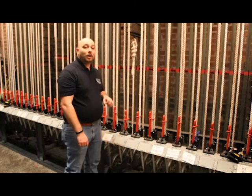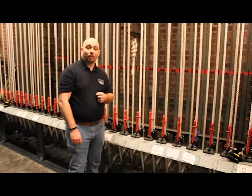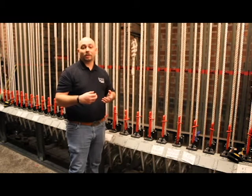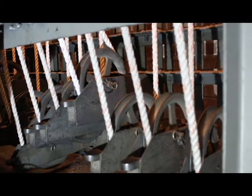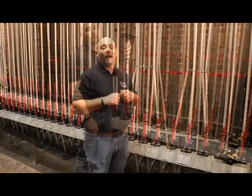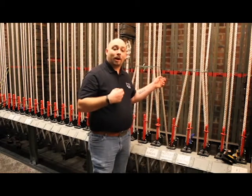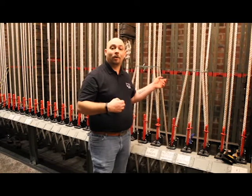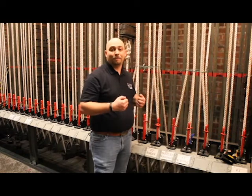Back to tension blocks, also known as foot blocks or idler blocks. The tension block in most systems is attached to the T-rail with guide shoes that allow it to slide and float, so that the weight of the tension block keeps the purchase line tight while still allowing an option to get some slack in the purchase system. Most counterweight systems use T-rails of some variety to create a guide system on the wall behind the locking rail for the arbors. It keeps the arbors from hitting each other as well as holding the tension block in place.